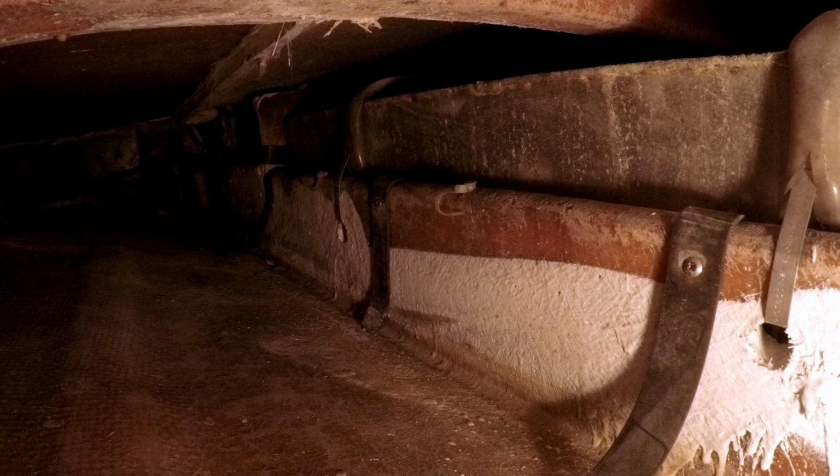You can see where the fish lockers were removed and glassed over. The wider I make the hole, the more access there is for the repair. There is a 2-inch by 3-inch support beam that runs across the top of the tank. This beam gives structural stability to the deck and sits directly under the steps on each side of the boat. Cutting this beam is unavoidable.